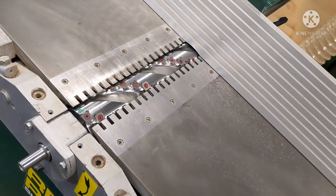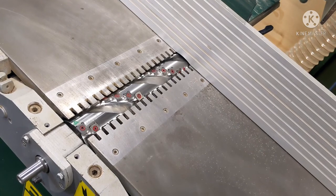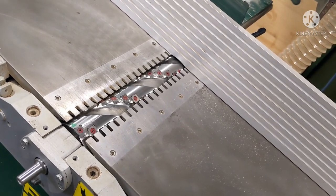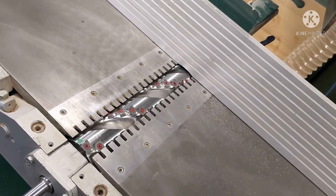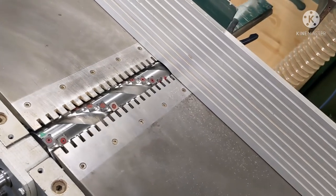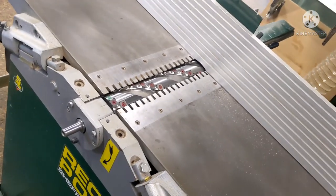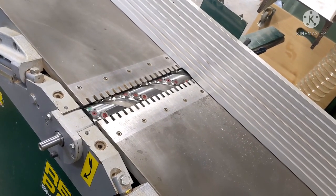You could probably fit it in about two and a half hours if you had new bearings. It took me longer because I had to reuse the bearings — I hadn't ordered any because I wasn't sure what size to get. I had to get them off the old rusted shaft without damaging them, and that's where most of the time was spent, making little jigs to pull them off. In the end it took me a day. But it's all set up nice, cutting really well. Couldn't recommend it enough — if you're thinking of getting one, well worth it.